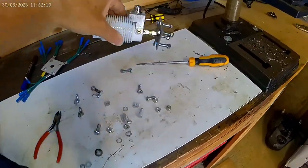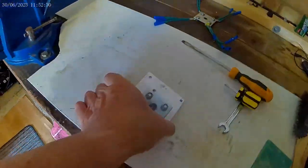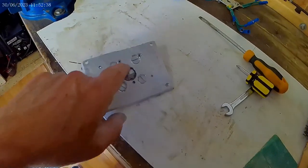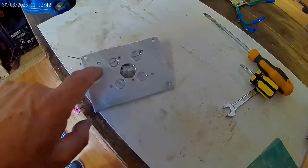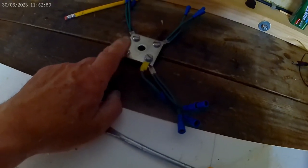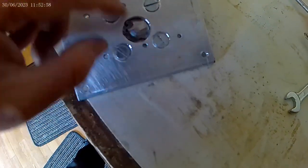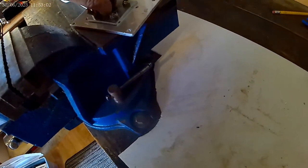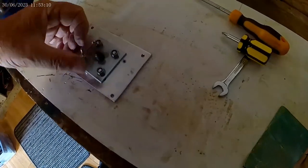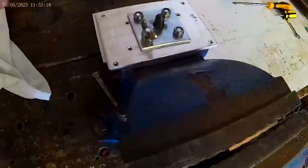That's the start of the coil mounting bracket that's going to go on the bike rack on the Mazda Bongo. Here's the bracket - it's not perfect, it's a scrap piece of metal. What I've had to do is bore a hole here to allow for the weld joint because this is aluminium and that's steel. I've had to borrow the countersunk screws from my portable aerial, but nuts and bolts are fine - it doesn't catch on anything. I've countersunk the screws here so when it's mounted on the cycle rack it'll be flat, and in here will be drilled for U-bolts. That'll go onto the bike rack - the U-bolts should be delivered today.